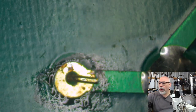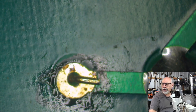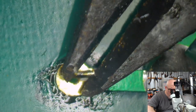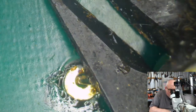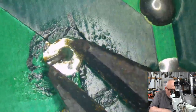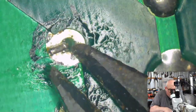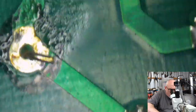One of the things with the old Mac Plus, Mac 128K, 512K, is, of course, none of them had fans. So a lot of these did end up with overheating, and you will notice certain places that have very visible signs of excessive heat, particularly around certain components. I'll point those out. Generally, it's not a problem. You don't really have to worry too much about that. Just because it's hot doesn't mean that it's not working properly. Some of these components just run hot.